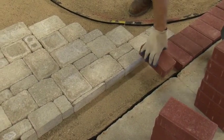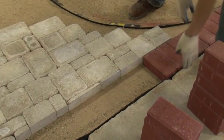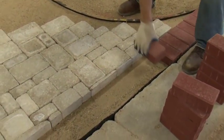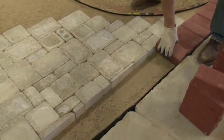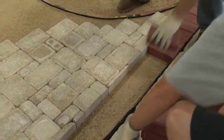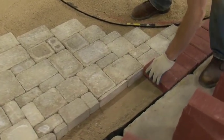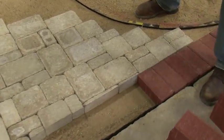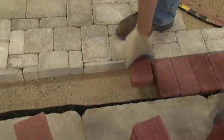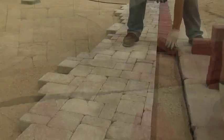When handling pavers, it is important to wear gloves or finger tape. The correct way of laying pavers is thumb to the inside, fingers out. When your thumb is to the inside, your fingers, arm and wrist are more capable of holding the paver into the pattern. When you're ready to set the paver, slowly release pressure from your fingers and the paver will slide into place. Doing this correctly eliminates displacement of the sand and reduces wide joints. If you were to turn your fingers in, not only do you have a better chance of hurting them, but your thumb cannot support the paver and it will drop unevenly into the sand causing disruption, wider joints and more passes with the compactor.